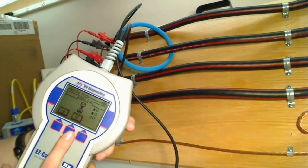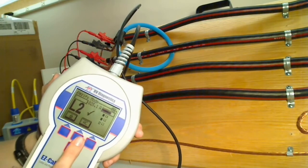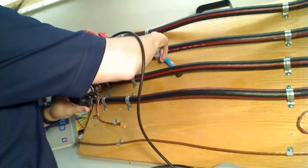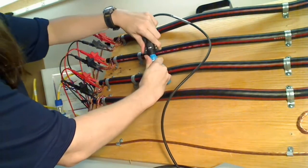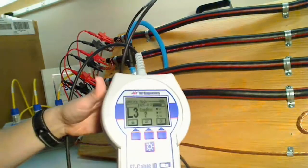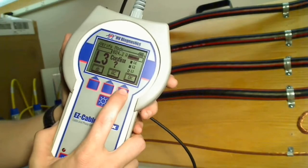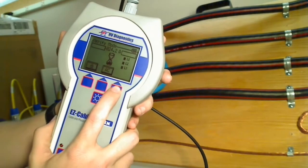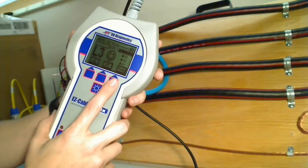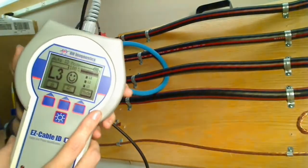OK. Now I'm going to wrap the coil around line three to verify or calibrate line three for the receiver. The arrow is facing away from the transmitter or towards the far end. It's processing. Now it's asking me if I want to confirm this data for L3 — I'm going to say yes. Notice how the L3 block has filled in. Now I'm ready for ID mode. All the data for L1, L2, and L3 have been stored to the receiver.